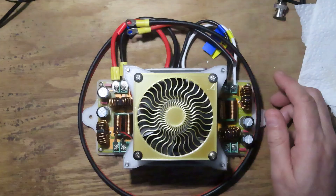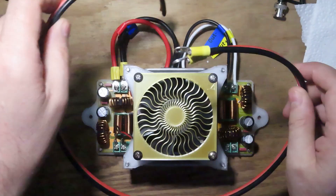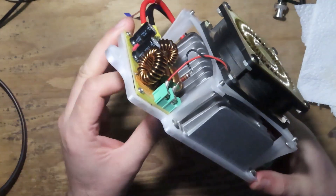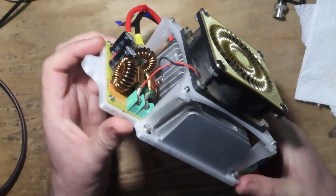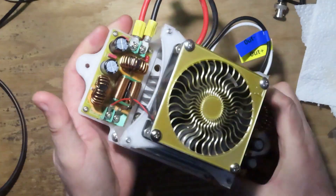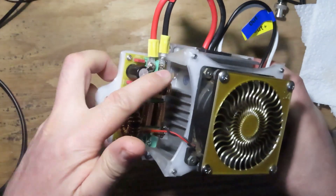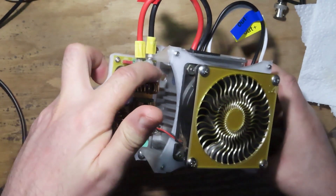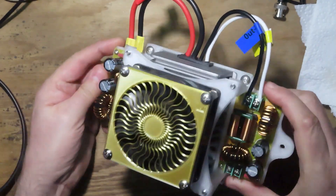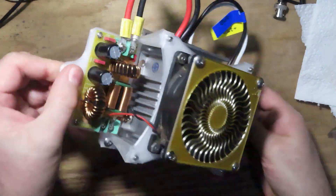I also designed a little frame and mount to put a cooling fan over the top of the DC converter. After some designing in FreeCAD, 3D printing, and assembly work, the mechanical assembly is pretty much done. I printed this in PCTG, which has a softening temperature around 178°F — way hotter than this module will ever get. There are screw mounts, and four screws will hold it up against the wall in my power cubby.